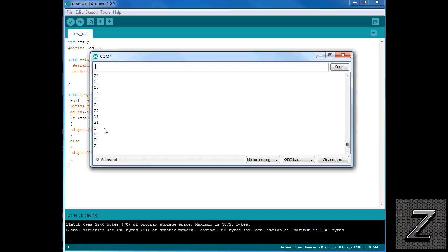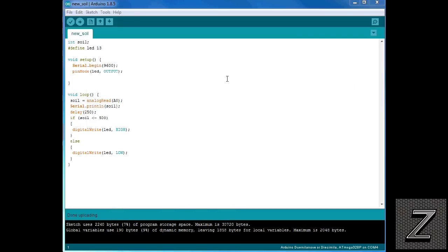But you can see right here, if the soil is completely dry, this is the readings you get. Now I'm going to go ahead and touch it. You can see it goes up all the way to 1023. So what you'll need to do is put this in the soil and kind of figure out at what moisture rate you want this to turn the water on. Now, I've set it at 500 right here, you can see, but we'll get to that in a moment.